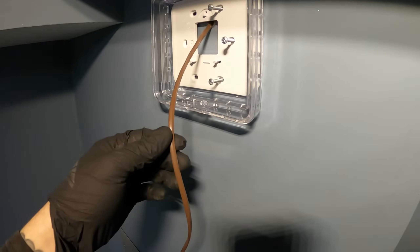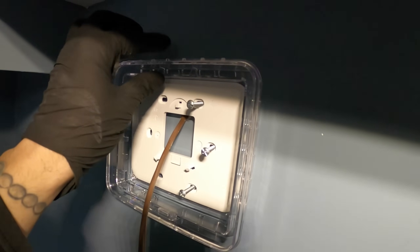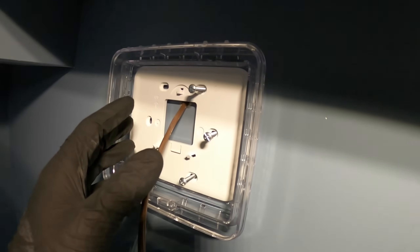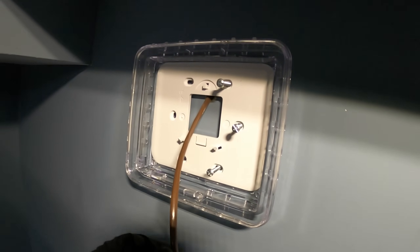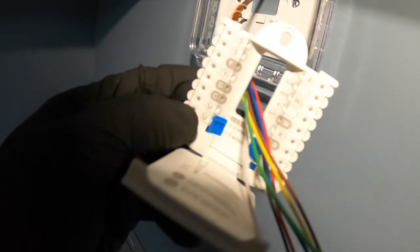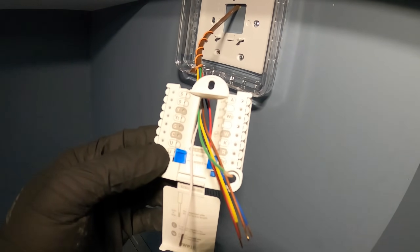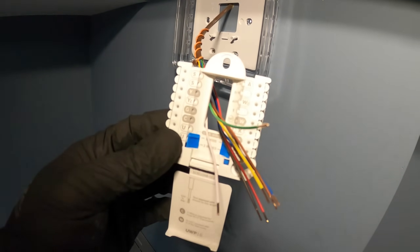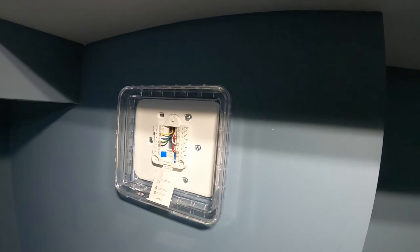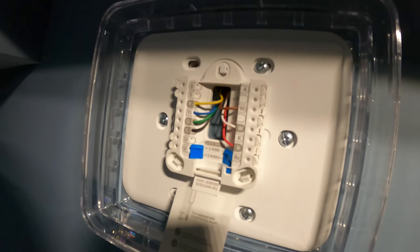Customer wanted a lock box, so I ran this wire through this guard and then through this little base cover. You could put some extra screws on as well, but once you lock down this plate it's pretty much going to hold everything together. Let's lock down these screws and get this set up. For this style of thermostat you have this base — basically just press down on this tab and push the wire through. I like to set it up out here. We're just going to match up the same configuration as on the roof. Everything looks nice and neat — colors and terminations all match up from down here to the roof. Here's one solid wire, no multiple cables, broken cables, or splices. Just one line — that's the way it should be.